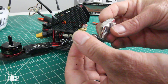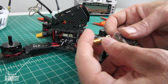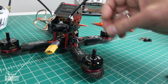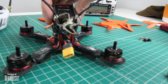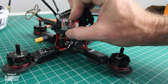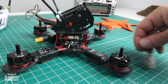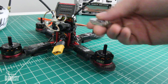This VTX separated right here in that crash coming off the tree. These things just don't hold up if they're not secured and hidden well inside the frame. There's not a lot of room in here — that's one of the challenges with X-frames. You're going to move stuff around a few times. This one was riding on the outside when it broke, hanging out the back, which is definitely not a good place for it. Don't put it on the outside if you can help it.